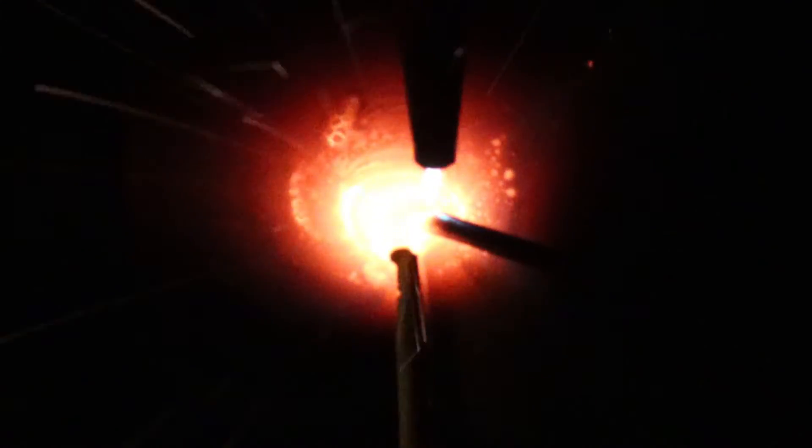As with previous gas welding, I need a nice smooth movement, making sure I don't get the tip too hot, moving evenly, and watching behind for any holes. I'm feeling like I picked too big a filler rod — I've got a 1/8 inch filler rod and probably could have gone one size down. I notice it's sticking to the material easily. Keep an eye on the liquid material going through the other side — it even makes a sound when you've gone through, echoing off the table.